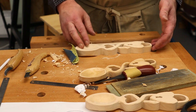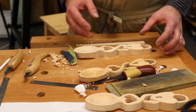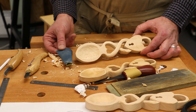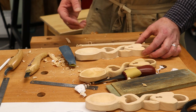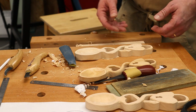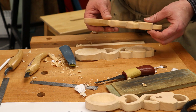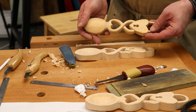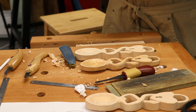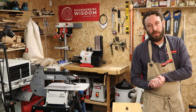Once you've done all the work you want with this lower grit abrasive — the 150 grit — get rid of all the tooling marks and keep going until you're happy with the shape. Put some hot water on to raise the grain, have a quick go with the 150, then progress through the grits getting finer and finer each time until you end up with a really nice smooth finish. Then just a drop of finishing oil to finish it off and bring out the natural beauty in the wood.